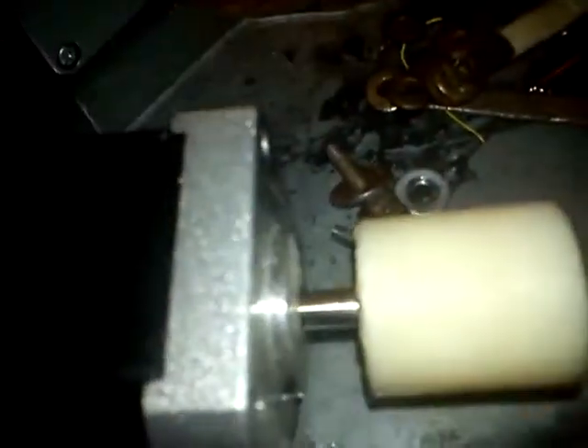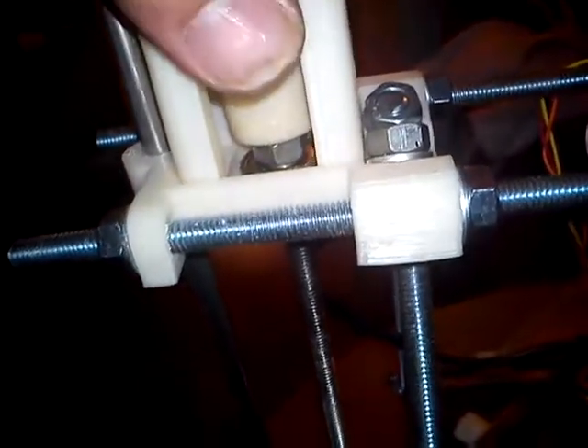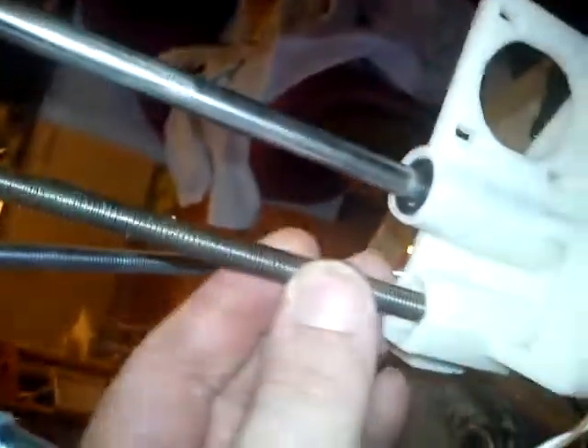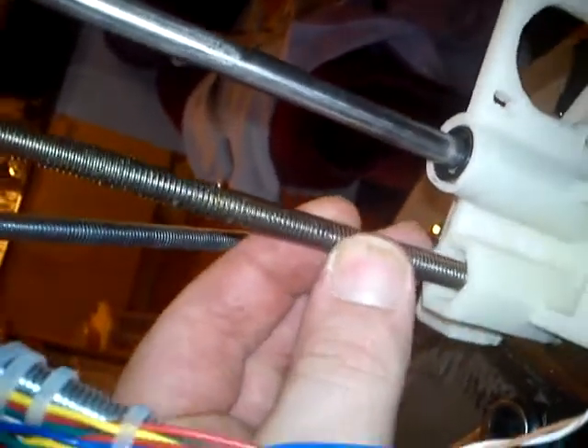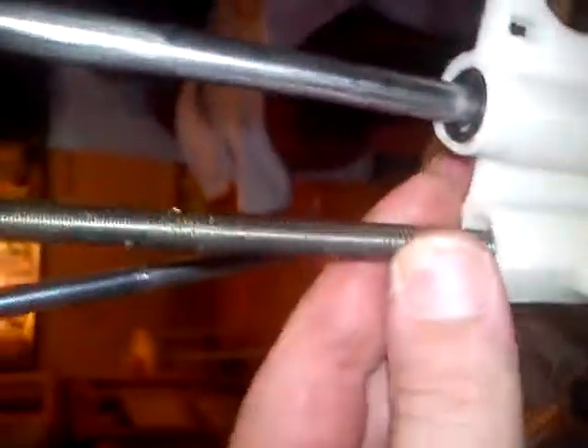And for the motor, I choose to have 8mm away from the motor, and a screw to hold it. I don't put it all the way down, because I want this to flex. It's able to flex and take away any wobble in the Z-rod. You can see it moves pretty freely.